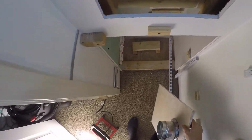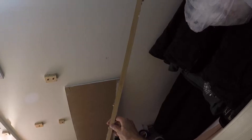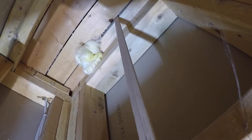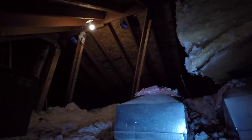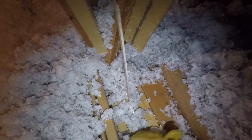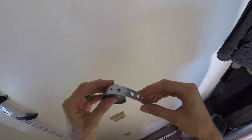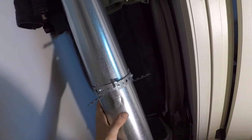Since we're done with that outlet we'll put the panel back. Before replacing the ceiling piece I cut a hole in it for the ductwork and added a transition that will connect to a piece going below the fan. Since we've got our hole in the litter box ceiling we need to find a corresponding hole at the very top of the dead space going to the attic. I'm using a scrap piece resting on a ledge so I can go up to the attic and find where it comes out. Always wear a respirator and be careful when working with fiberglass insulation in the attic.